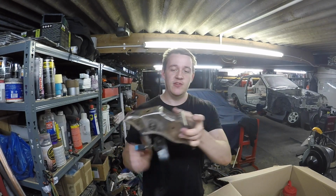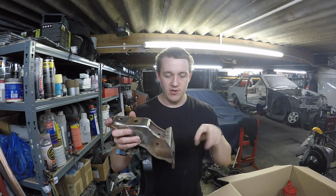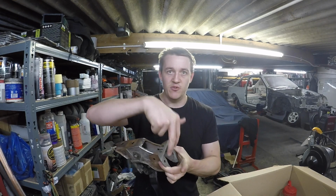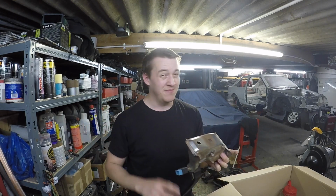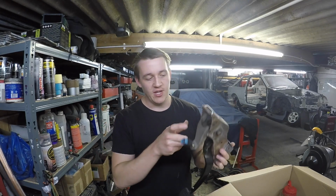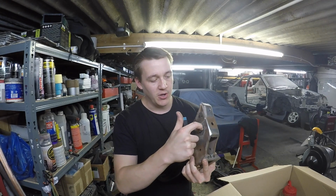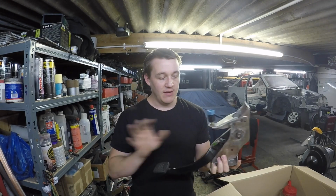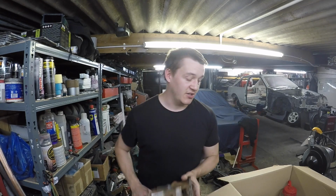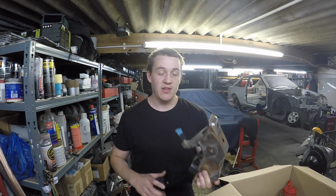And then they converted this single master cylinder pedal box, that had a single cylinder that went to front and back, to a dual master cylinder bias pedal box with AP master cylinders on. So I've done the same. It replaces the majority of this. I think it just keeps this bit, and then we might keep both the bolt and these plates that go on the side. Everything else I've got brand new. Oh, maybe that as well. So we just need to start bending it up, and then weld it all together, and then it'll go to zinc.